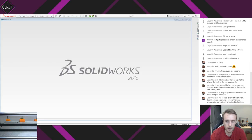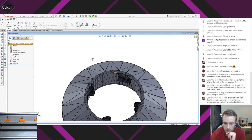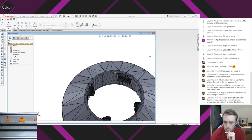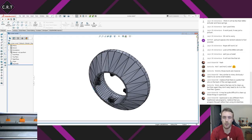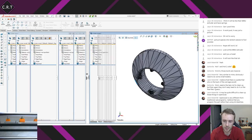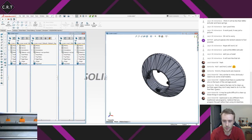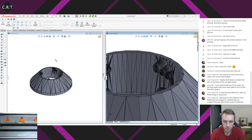And I think the last part, the Z screw cover, that's, as far as I remember, just the same. The Z screw cover sits at the interface between the lead screw and the stepper motor. It basically stops any grime and dirt getting down into the stepper motor. Yeah, they are basically the same.